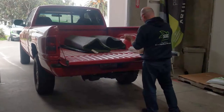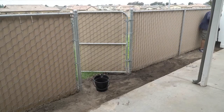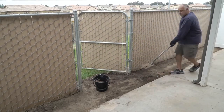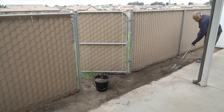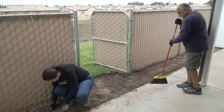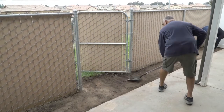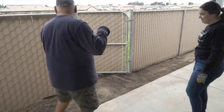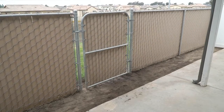After picking up all of our material at the San Marcos store, we got it back to the house and finished excavating the site. We opted out of using a subbase for cost and labor reasons. If you have a bigger or unleveled space, or if the dirt won't hold the nails well, I'd definitely recommend subbase — it helps prevent weeds and movement of the turf. The recommended excavation depth is 3-4 inches with subbase. Because we didn't use subbase, we excavated about 2 inches below the cement line, since our Arizona Pro grass is 1.7 inches tall, and we didn't want a huge dip going from the patio to the grass. We removed as much organic material as we could, then compacted the soil with a square nose shovel — a hand tamper would have worked better, but we didn't have one.